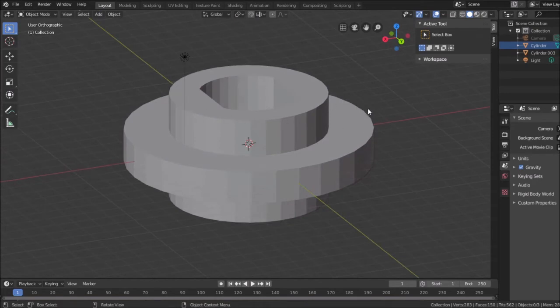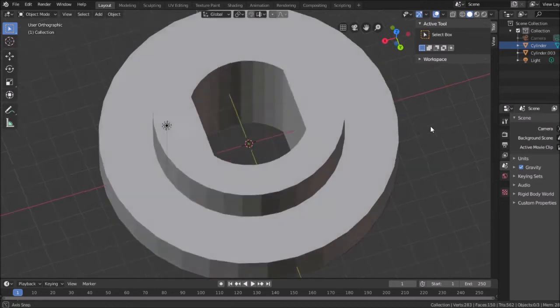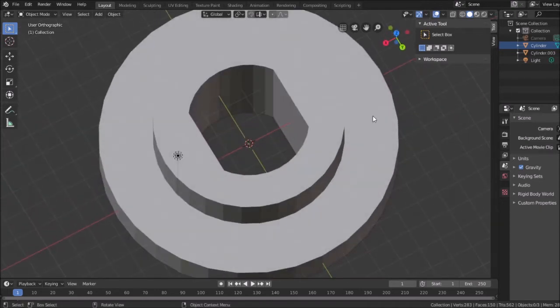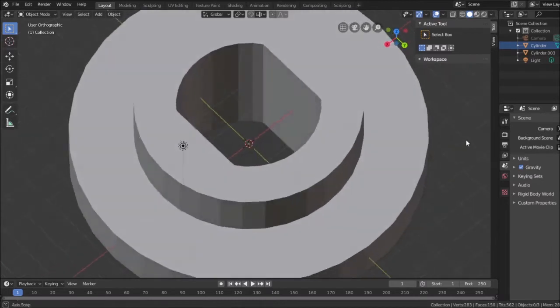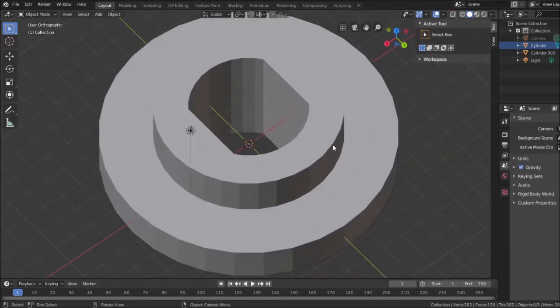You may remember from the previous part of the video, this actually had a circle around it, but then the center of the base piece was the shaft. I don't know if anything will be in the way. So what was that? My diameter between this was the inside diameter of the metal contact sweep. It was 8.3 millimeters.